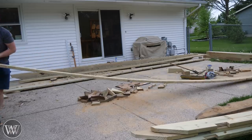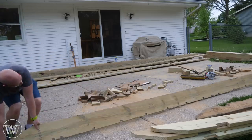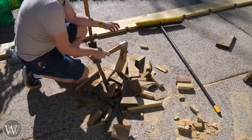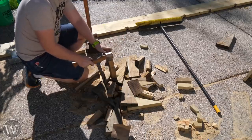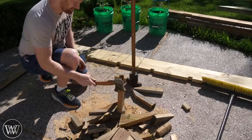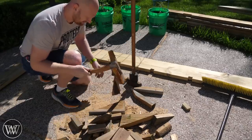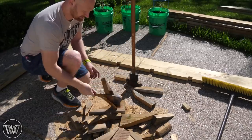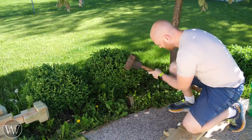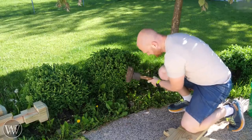You can see how these 24-foot beams are — well, they're rather large. I can lay them all down here to find out exactly where I want those 6x6 legs to go. But in order to stand up those 6x6 legs, I need to actually brace them. So I'm grabbing some of these angled cutoff slats and turning them into stakes — trying not to hit my hatchet on the concrete. These stakes are what the diagonals can connect to in order to hold these legs upright, so a couple of these around each one makes it a lot easier.